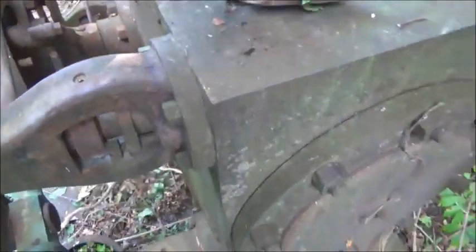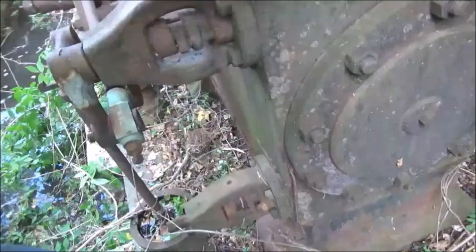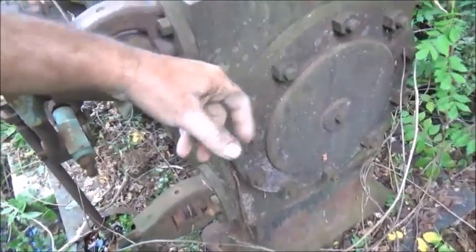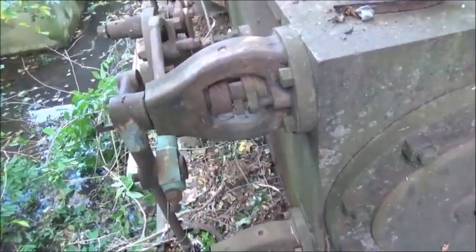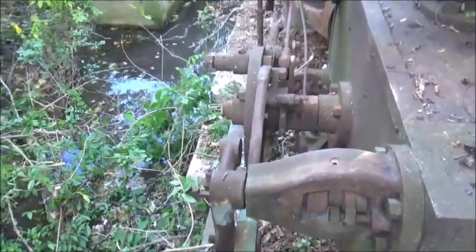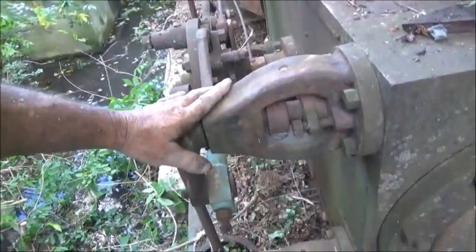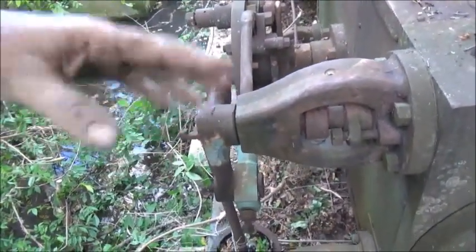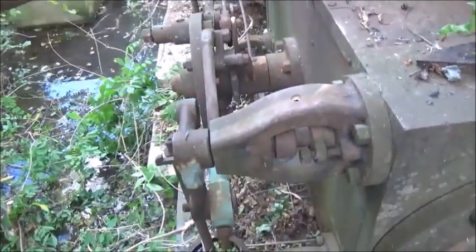So there's the head. This is a 14-inch piston, 36-inch stroke - so 3-foot stroke - 14-inch piston, 10-foot flywheels that are 19 inches wide. They don't list the horsepower but I think around 175, possibly 200 horsepower. I think it ran around 85 RPM, which is not very fast, but that's why it's not a lot of horsepower.